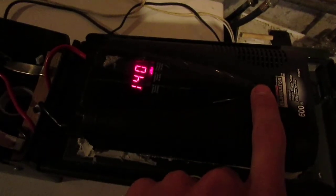I'm going to turn this upstairs one on. So I have three CFL bulbs on the main floor, one here — that's four, five, six, seven, and one over here — eight. This is a temporary room. So I've got quite a few CFL bulbs on. Sitting at 12 volts, fans are blowing, and this says we're taking 140 watts.